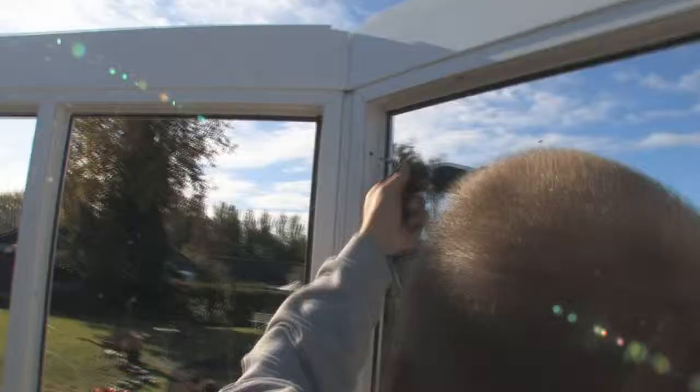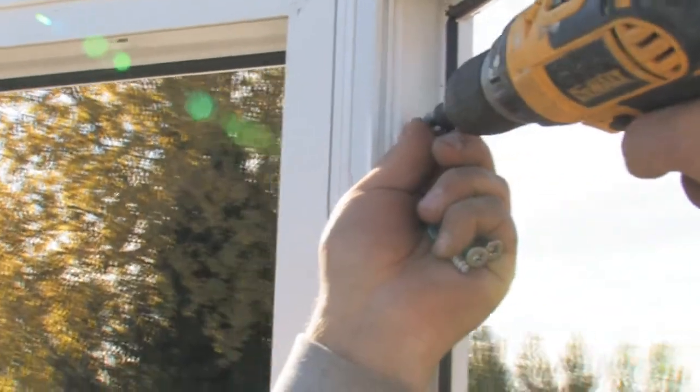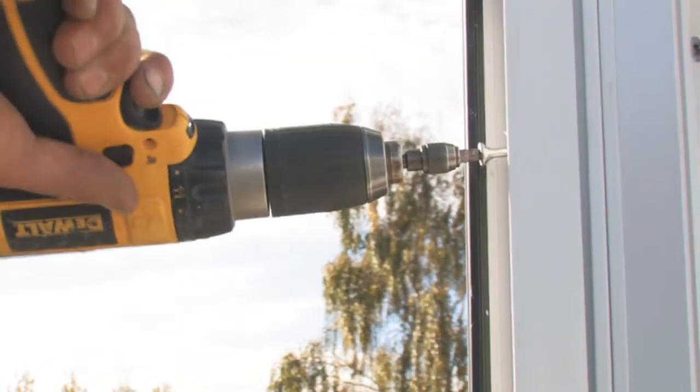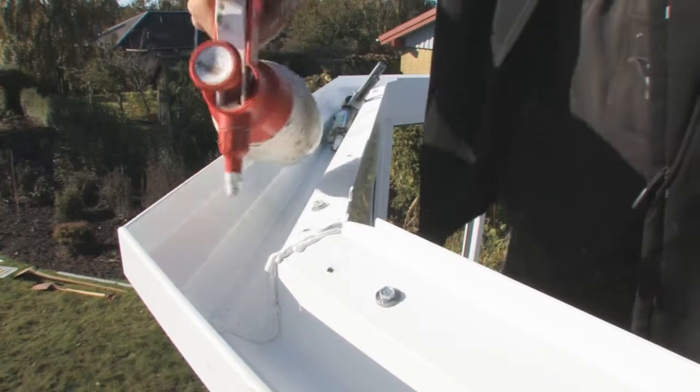When the gutter at the door has been secured by screws up through the element, continue around the unit tightening every second screw. Having done this, finish tightening the elements at the top as before. Do this by means of a screw clamp and 55mm screws. Then join the gutter inside using our 3M joint sealant. Use plenty.